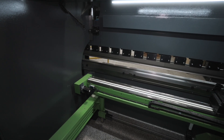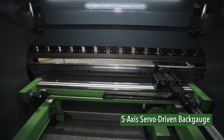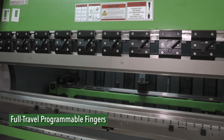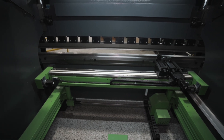The Evo3 hybrid offers a five-axis standard precision servo driven and motorized back gauge: a 31.5 inch x-axis, a 9.8 inch r-axis, full travel programmable Z1 and Z2 fingers, and x-prime which allows for plus or minus four inch adjustment or for gauging tapers.